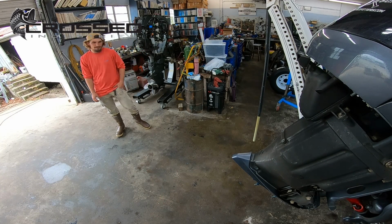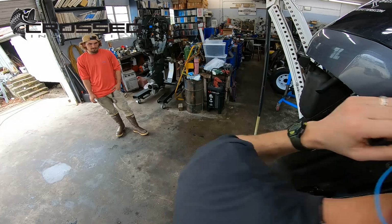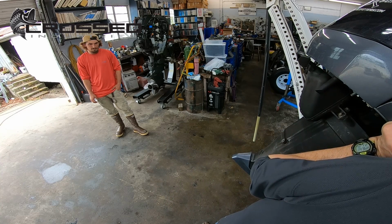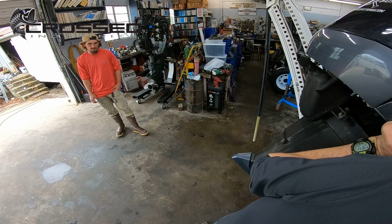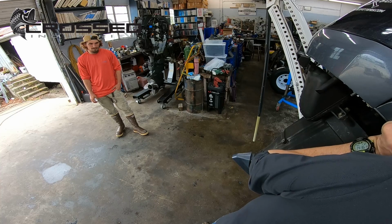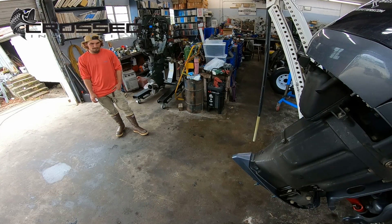I've never messed with the Phantom or whatever that other one is. Atlas. Look, here's the problem I have. I have to have an 8-inch setback just for this brand of boat, and Atlas doesn't make an 8-inch setback, so I have to use a 4-inch spacer with a 4-inch jack plate. These extra bolts get loose all the time. The way Basshead does it, we have 6 bolts going into the transom, so now I have 16 bolts I gotta check every other month. I tighten them all the time and this comes loose.